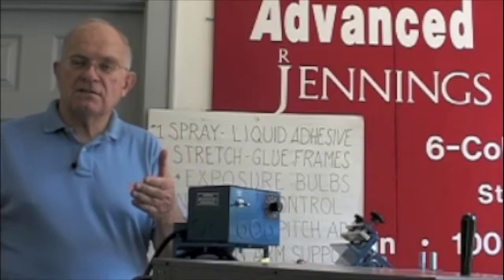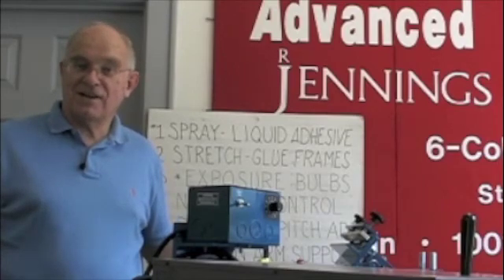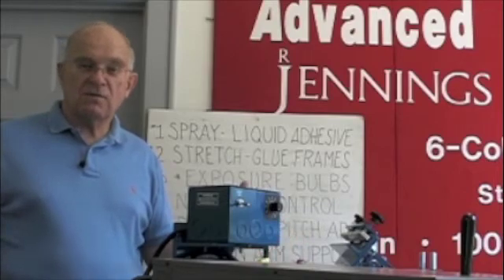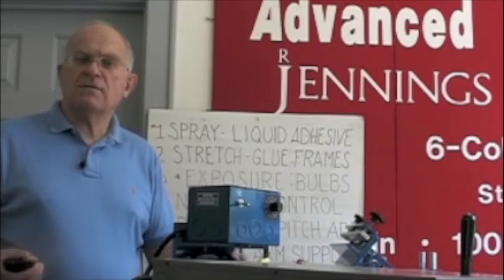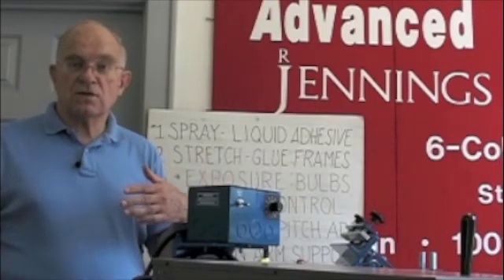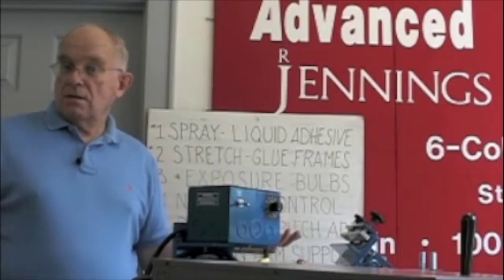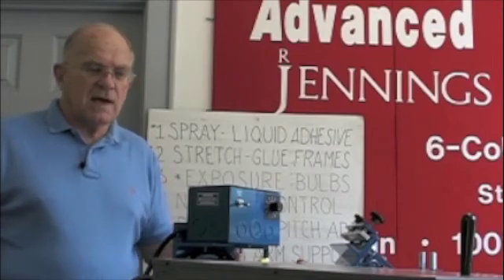It's like having an oven in your kitchen with just an on-off switch — that's what these manufacturers are selling in flash and conveyor dryers: it just comes on full blast hot. In your kitchen, if you're cooking a turkey for three hours, you don't want real high heat or you'll burn the outside before you cook the inside. Other times you do need high heat. You need control depending on the cooking conditions, and the same goes for screen printing. Inks can be different thicknesses, have different pigment amounts. You can have a heavy sweatshirt, a cotton shirt, a 50-50, or a 100% polyester and nylon shirt, and the curing requirements of each are really quite different. You have to have control.